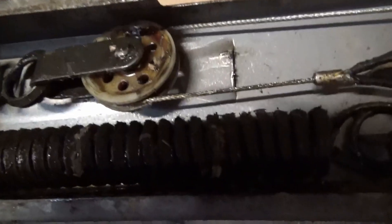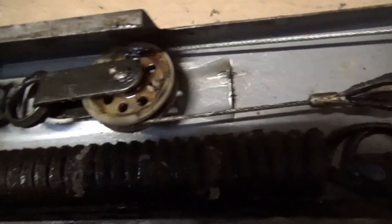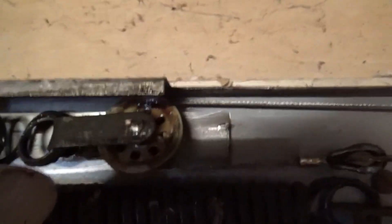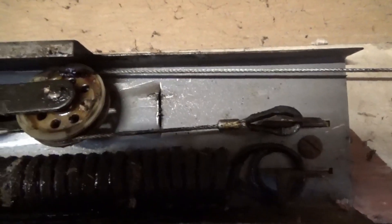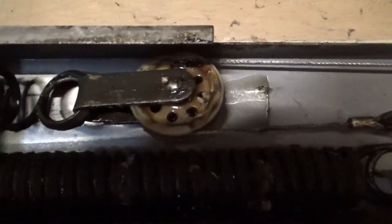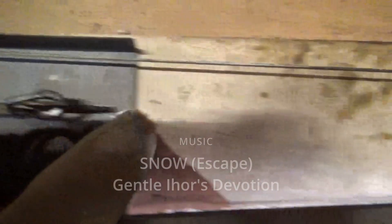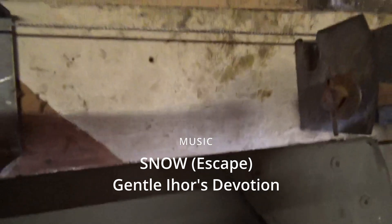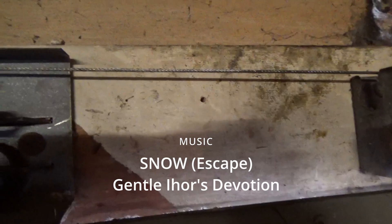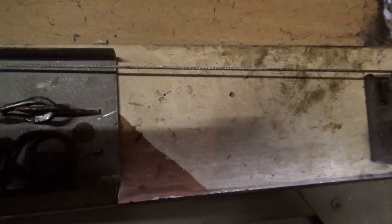When I did it I had to get a screwdriver to just lift the pulley away from that slot so it didn't keep engaging when it went back. But the key thing is to put that screw in there, get that little roller on, tie your cord to the spring, and pull down using your weight or somebody's weight to extend the spring. That's the key to the whole thing. Hope that helps.